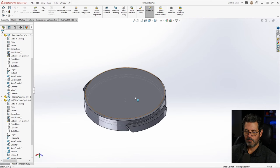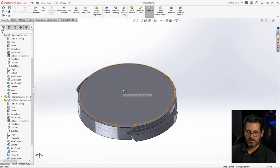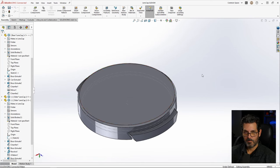And then we can create a logo that has a thickness. The way I'm planning on handling this is you create a logo with a thickness, and then in the slicer, you just set it on top of there and line it up. That way you don't have to edit the part every time. So you should be able to download these STL files and then create your own logos, lay them on top here in the slicer, and print everything with a material change in the middle of it. And I'll get into that here in a second.